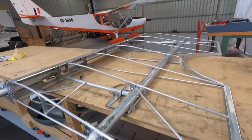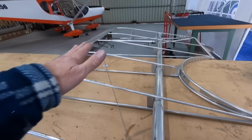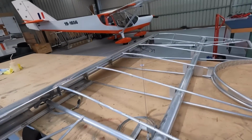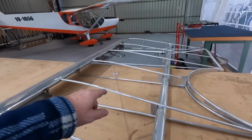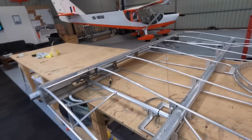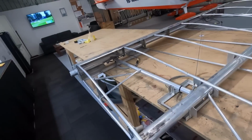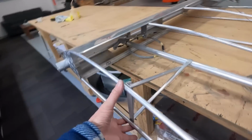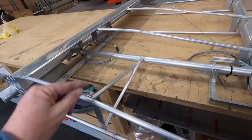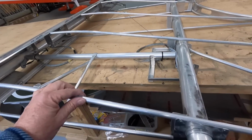All right, so on the centre wing, I've drilled all my holes on the top surface. If you notice, I haven't got a bottom rib on every second one, so there's only three bottom ribs plus the 2 root ribs. Missing 2 because of what's occurring here. Made up a stay. This does 2 things: stops the vertical crush and also the in and out. So I just ran those across to the compression strut, nice and strong.